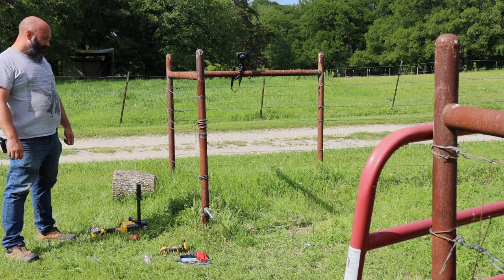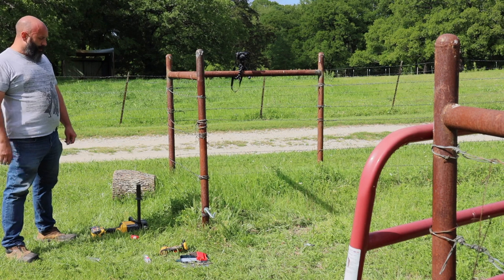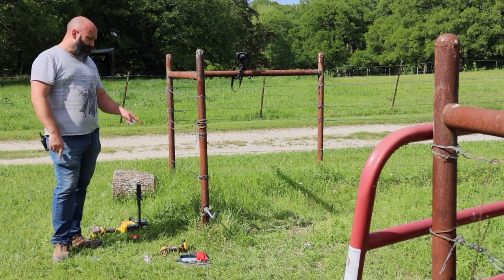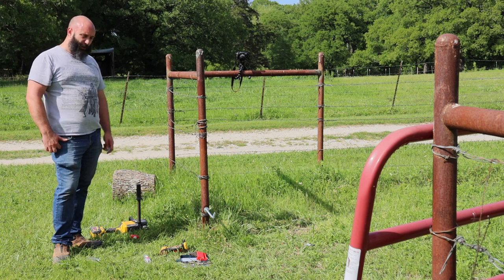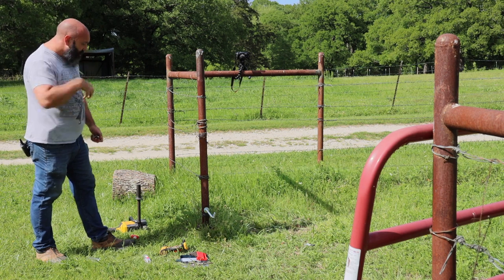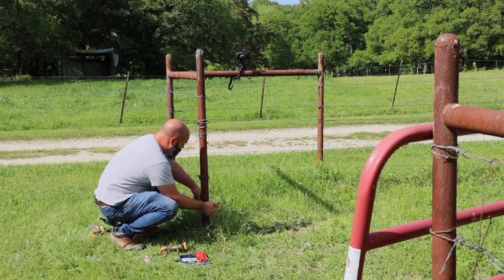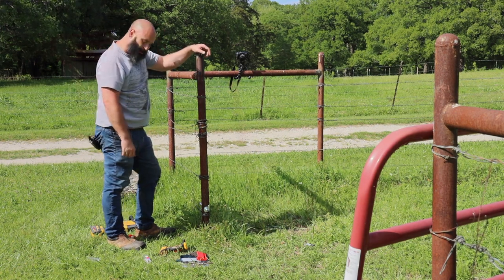We're through. We just got to get this bolt in properly, and that three-quarter got us there, but it definitely was getting stuck at the end because of just the curvature of the metal. I believe this is a 5/8. I believe it's a 5/8 bolt. That's why we're getting through with just shy of a three-quarter drill bit. So there we go. One down. Let's tighten this one up here. All right, one down. That was fun.